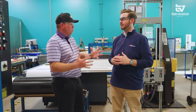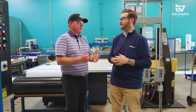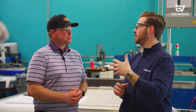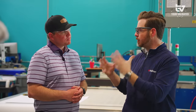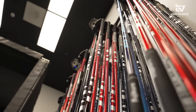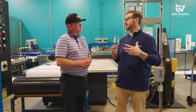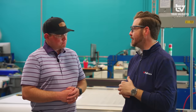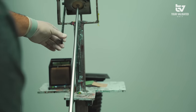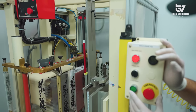Now that we've seen cutting, rolling, baking, and breaking, we've got almost finished product. This facility lets us do everything from prototype and ideation all the way to finished cosmetics. That's the last step — making it look pretty. We have an incredible team of graphic designers, painters, and techs with two to three decades of experience between them. They take the raw shaft, put it in an apparatus, pull the paint onto the shaft, let it dry, then apply a heat-applied decal. That basically finishes it up.